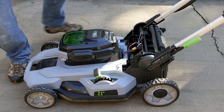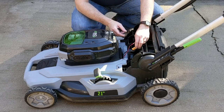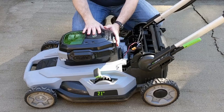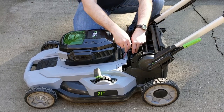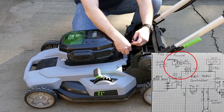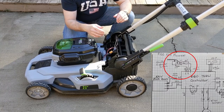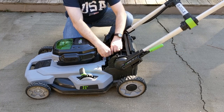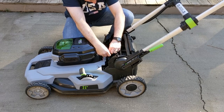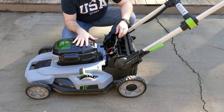These EGO mowers are known to have some issues with wire pinching, and these wires have definitely been pinched in the past. That's usually when the mower won't try to come on at all — you just hit the button and nothing happens. That issue involves bypassing this red and black cable as an input, and people have already solved that. But our issue is not that — I've been asked about this issue on my channel but this is the first time I'm working on it.